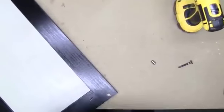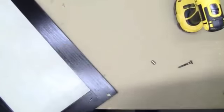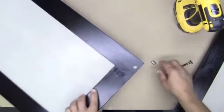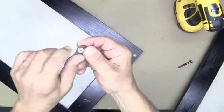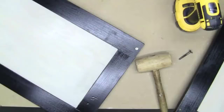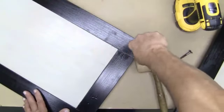Now, as before, when I showed you the samples, I drilled a 1/4 inch hole through the side panel, and I've also drilled a 1/4 inch hole into the end of the center panel. And you noticed, finally, I've drilled the 3/8 inch hole, but not all the way through. Now I can insert the cross dowel and align the slot so that it'll accept the connecting bolt. Here we go. We'll align the slot.